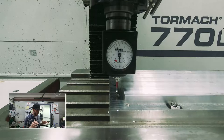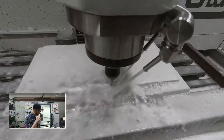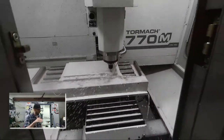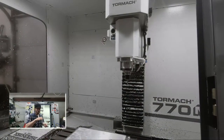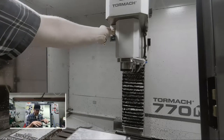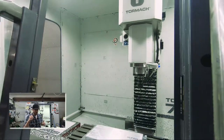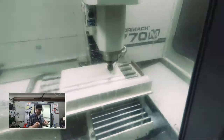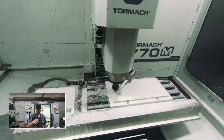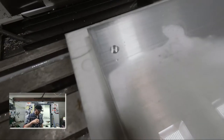Using the quarter-inch cutter I know it'll be perfectly flat. I surface the top side, then take the fixture plate off and flip it so that flat side is down on the base fixture plate. Once it's in place with the Mighty Bites, the first thing I do is run the drill paths — that puts four screw holes in to lock the plate down. Then I run a counter-bore cycle; I've really been using 6-32 screws to hold these in and it's been holding pretty well.